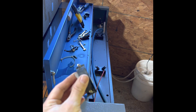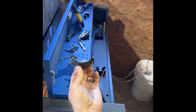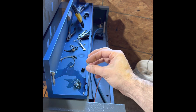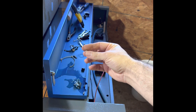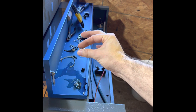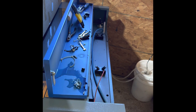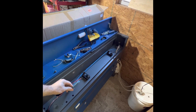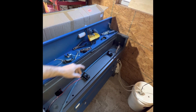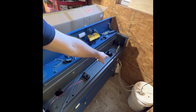You need a number three Allen head just for the brackets to hold the laser tube in, and then a number six metric wrench for the back. I will warn you that this is kind of a pain to get out — I could only get three of the bolts out, and that far one by the blue hose I had to wait until the tube was out to access. It's fairly simple: you have a water tube going into the top, a drain tube down there, a red wire to red wire, and a black wire to black wire.